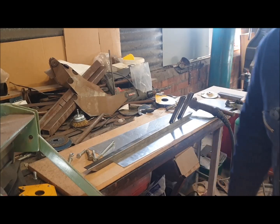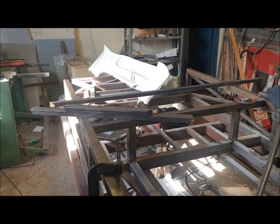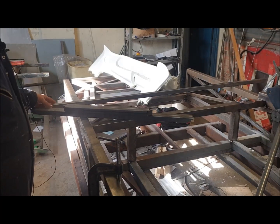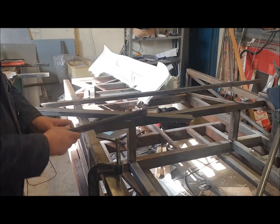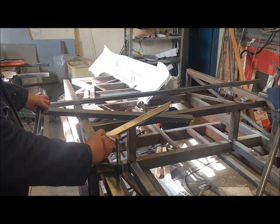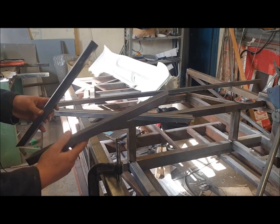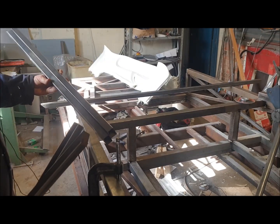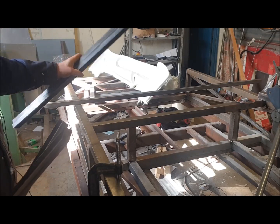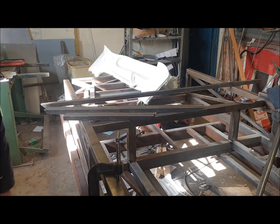Right, now for the rest of the dash frame we need the rest of the T3 labelled tubes: T3003, the long one; two tubes that go at the side of it which are T3001; T3004, there's two of those; and then finally the T3005 tubes that we just tacked the T3006 tubes to.